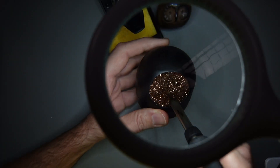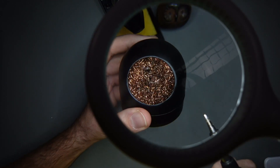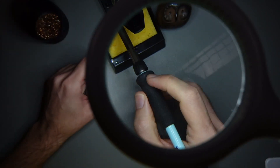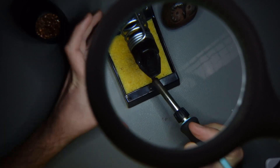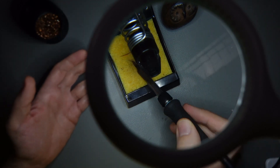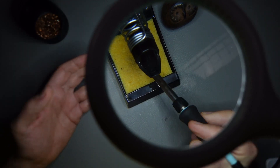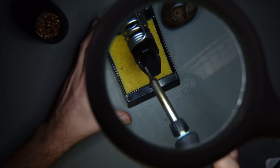This is how I clean my soldering iron, and you'll see it in the other videos. This is brass wire, but you can also use this technique, which is simply water on a sponge. Now, this is not just a sponge — it's a sponge that can take heat, and you should not just use a regular sponge here. This is a special sponge for soldering irons.